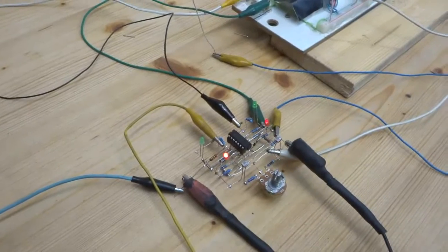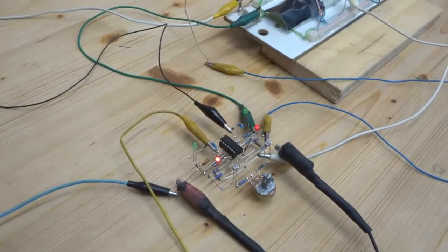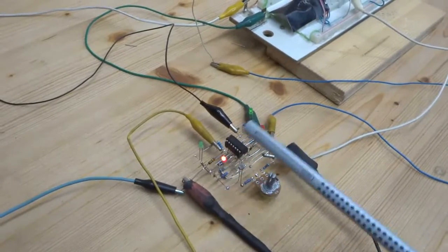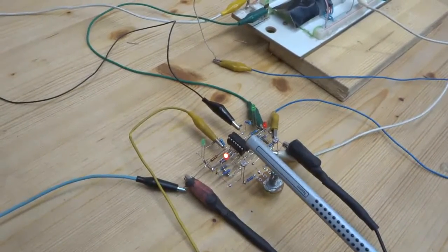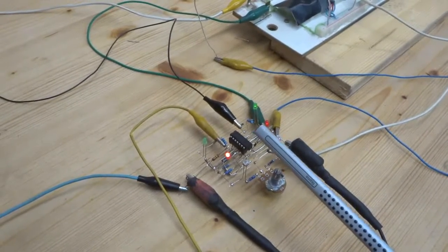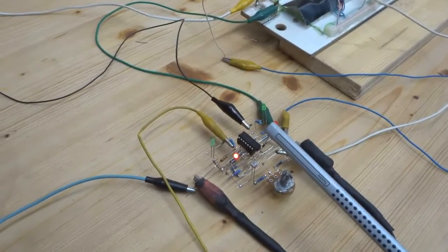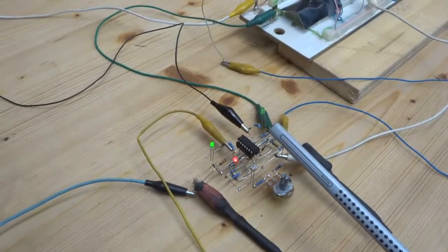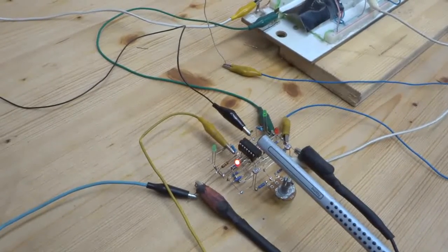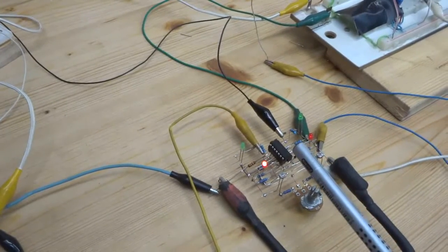And the green ones, they are connected to the Schmitt trigger, so they have some hysteresis where they ignore all the fading from these LEDs here, and at a certain point the relay kicks in, the motor drives the solar panel, and it turns off. And if the solar panel is off in the other direction, the other relay kicks in, the motor turns the solar panel and turns off the relay. So there is some leeway in between where the solar panel is perfectly aligned with the sun.